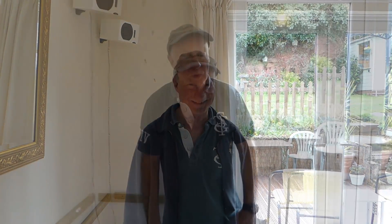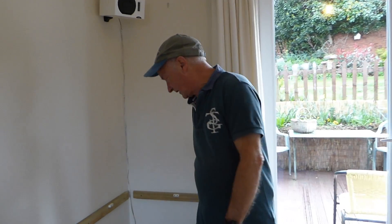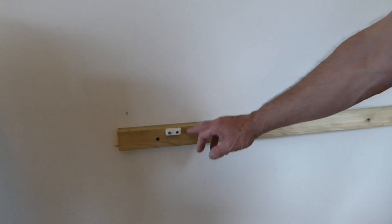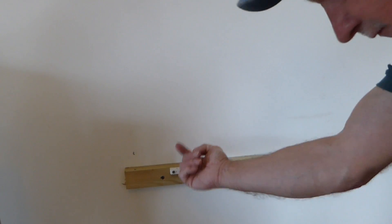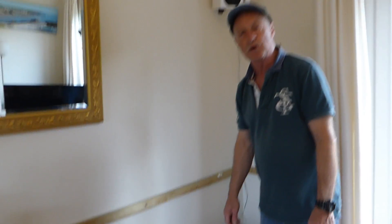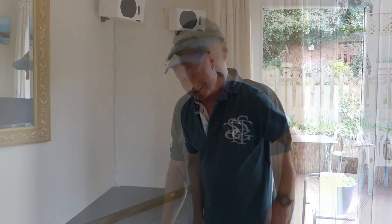The next tough bit is cutting the worktop. We're nearly ready to put our top on now — I've cut it to the length we want. I've put on some of these blocks; you can get L-shaped brackets as well. They're just to screw through to hold the top so it doesn't pull away from the wall once it's in. So without further delay, I'm going to get the top on — you'll probably need a hand for this bit, it's a two-person job.